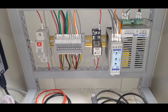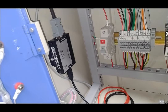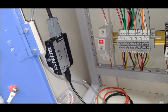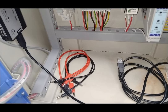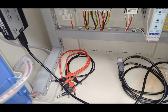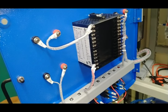The signal isolator isolates the 4 to 20 milliampere current from the transmitters before providing it to the PID controller — the same value is provided at the output but in isolated form. The SMPS converts 230-volt AC to 24-volt DC at 3 ampere to power all sensors and components. There is a USB-to-UART bridge converter for communicating PID controller data to the SCADA system, connected via a USB cable to the PC. Patch cords are used for connecting transmitter output to PID input and PID output to the electro-pneumatic converter.